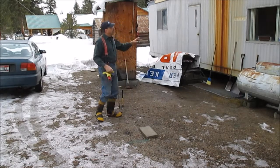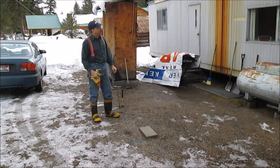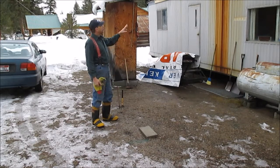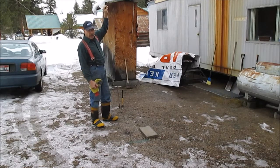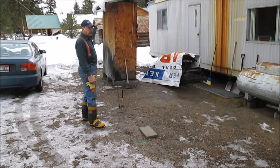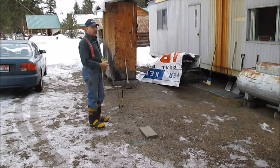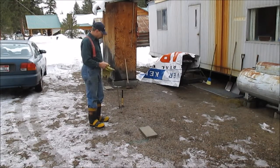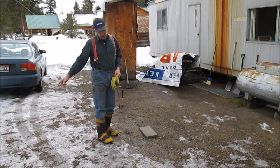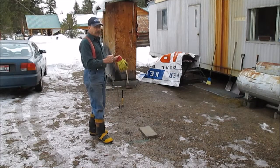Well, we'll take a string and come off of our lintel there, our plate, our sideways plate anyway. I don't know exactly what I'd call it. I've been calling it a lintel. Anyway, we'll come off of there with a string and a line level to the top of our posts and get the height on each one of our posts here, and that'll establish our level for our beam going across this way. So pretty simple process, but you got to have some bracing. We'll put another pin over here and maybe another one to especially brace this first post extremely well, that we can keep it plumb both ways.